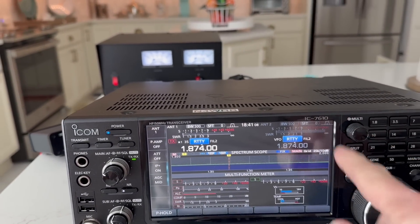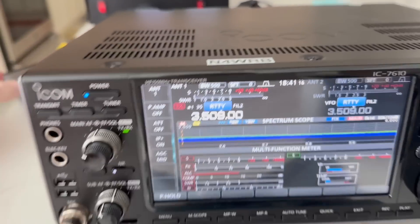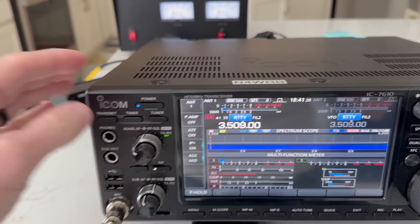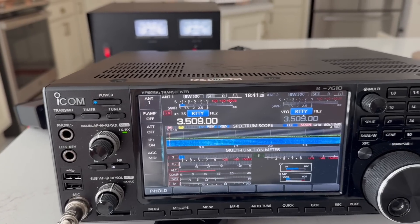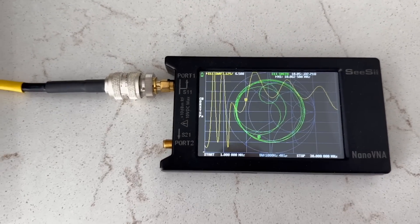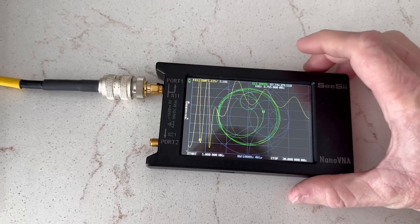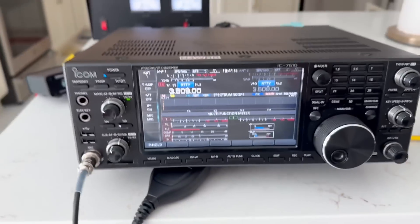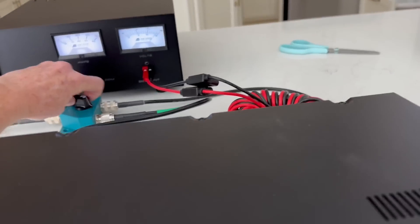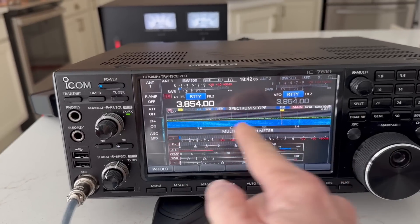So I'll go back down to 6 watts — experimentally found that 6 works well for the rest of them. We'll go up to 3.5 megahertz, press the tune button, hit transmit, and it comes up with a solution within a maximum of five seconds. Taking a look at the result, this is not quite as good — at 3.8 megahertz we've got about a 2:1 SWR. It would be better right around this area here, but that's okay because that's where most of the action is.